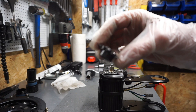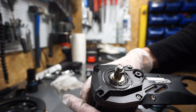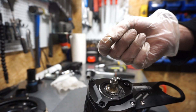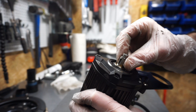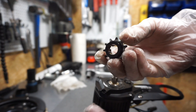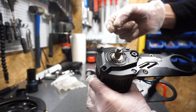I've removed the sprocket — it's quite hard to take out. Without the puller it's impossible; forget about pulling it out by hand. The sprocket is held in place by a common metal piece which goes into the recess of the shaft. You can see the recess for this piece on both the shaft and the sprocket. Now I can take out the circlips and get access below this cover.